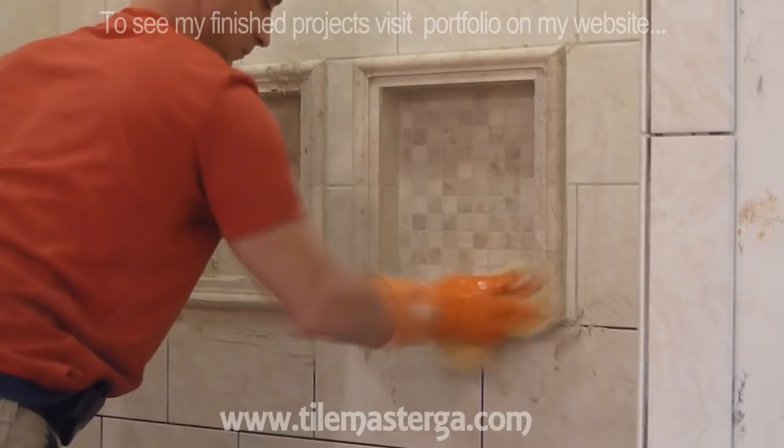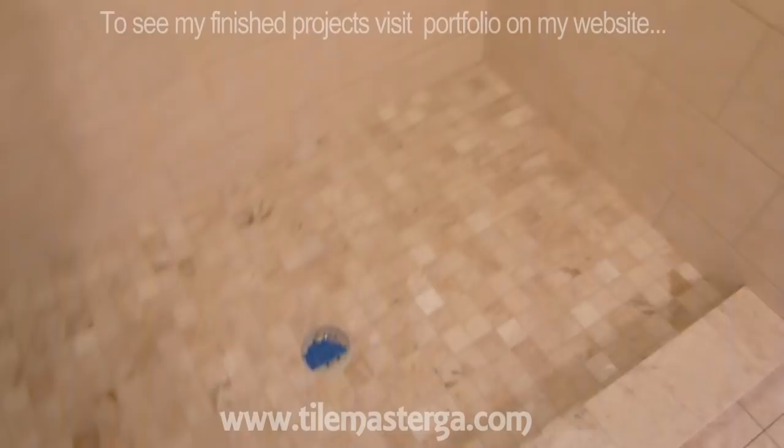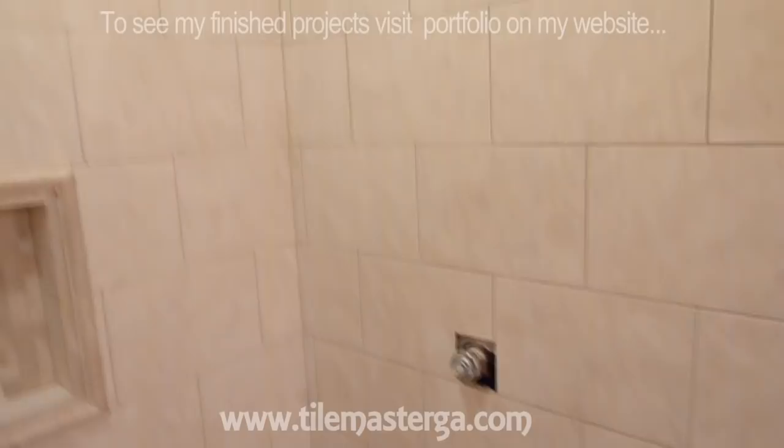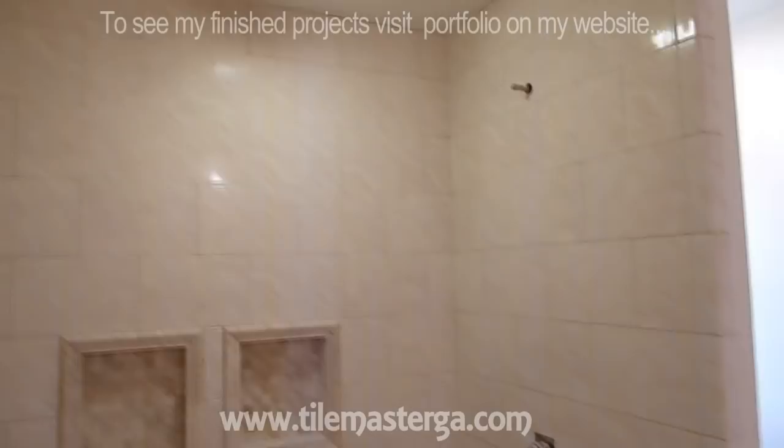Okay, so I just finished grouting the shower. It will be drying till tomorrow. It's usually good to leave grout for 24 hours at least to settle and dry before applying sealer or doing the final cleaning. So this is pretty much the way it looks right now. The grout still has to dry, it's still wet, but it will blend nicely with the tiles. And yes, this is another nice project, and tomorrow I will work on the fixtures and I will show you the final result.